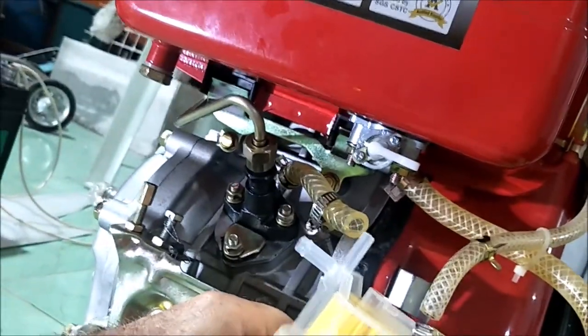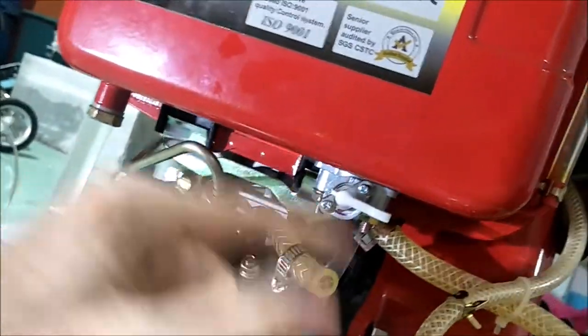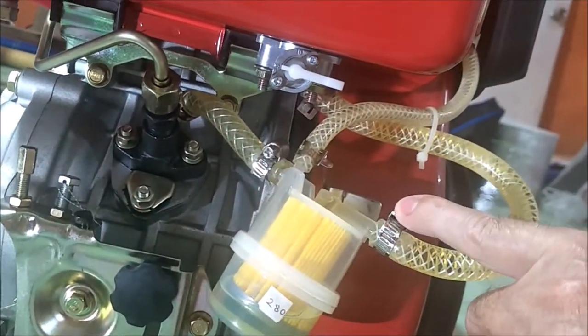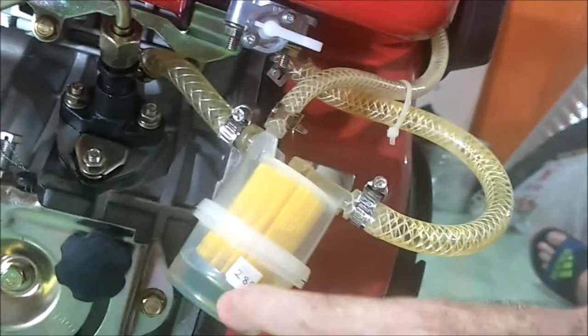The fuel is off, so I'm going to reconnect this and then we'll move to the next steps. I'll fill the tank somewhat and then take the fuel line off and run it. We got the fuel filter on, put the proper hose clamps on where I had the right size. I don't have one small enough for the air vent return, but that's okay. We put fuel up to about a quarter inch above where it starts to show in the sight tube — just enough for testing.